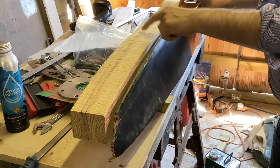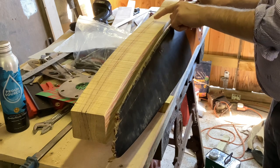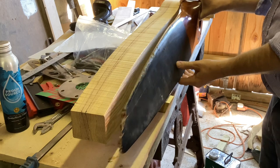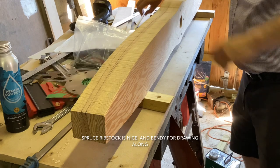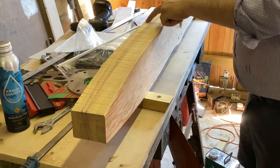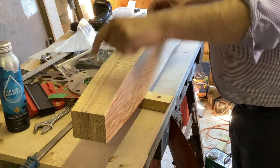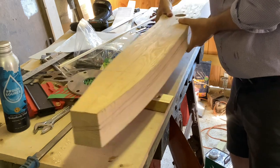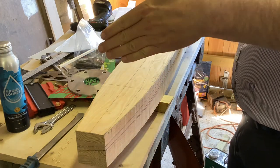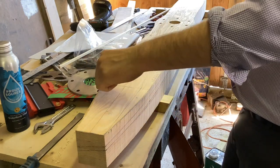I plotted the 75, 50 lines — actually a bit further in — being conservative since I can always remove more material than I can replace. The 35 line is there and I'm slightly behind it, knowing I may need to thin the blade more. I marked that with a piece of rib stock from the shelves. This line, starting at 35 percent where the blade finishes being full width, is effectively the taper of the blade — marked on both the trailing edge side and the leading edge side. Once bolted down, I'll be cutting level down to that taper line on each side.